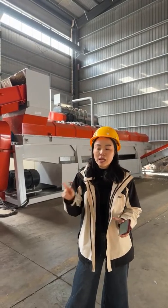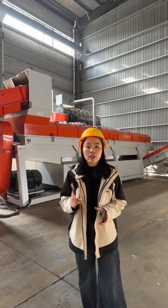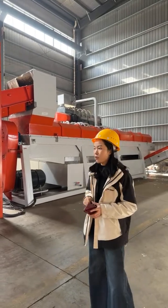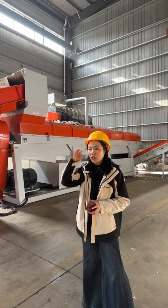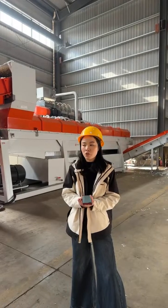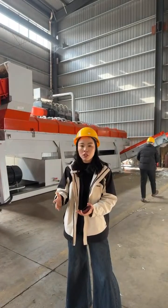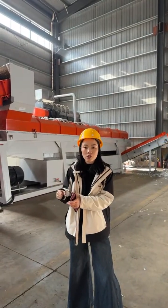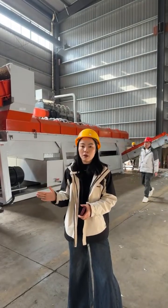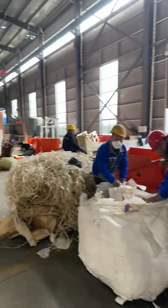For the plastic and aluminum separation process, if you are interested, you can send us a message, and we can send you a reference offer. More than 90% of our customers, when they process the Tetra Pak material, put the plastic and aluminum composite film directly into hot melt granulation and make pellets. So they will make other low-grade plastic products. Now we are loading another type of material.